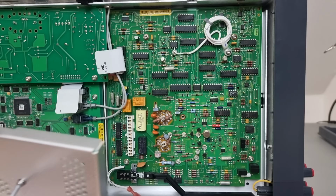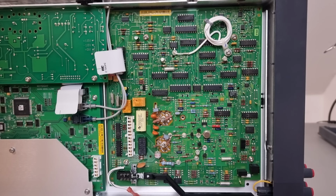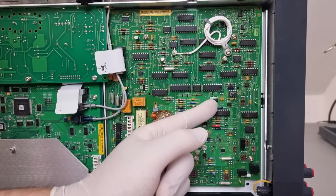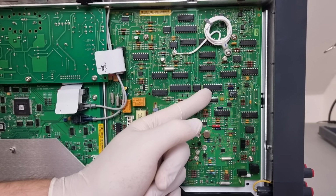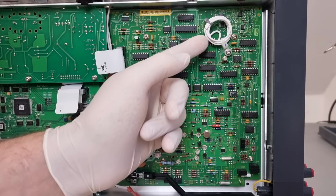The A2 board that converts AC into DC signals with proportional RMS values speaks yet another design language. Yellow silkscreen, some traces with square corners and no teardrops. There are some SMD components in the top right corner where previously an Elantec comparator lived. Obsolescence of the EL2018 has given us quite a bit of trouble, and apparently Keysight too. Everything else is pretty much the same. Lots of analog switches, and our old friend the Teflon cable sample and hold capacitor is also still around.